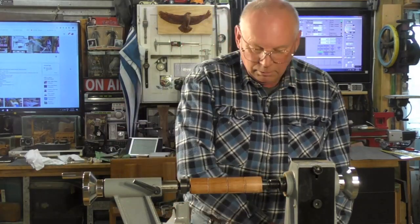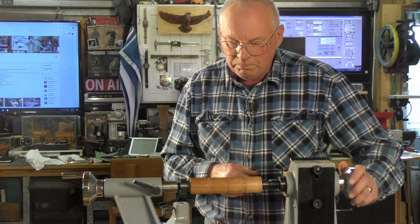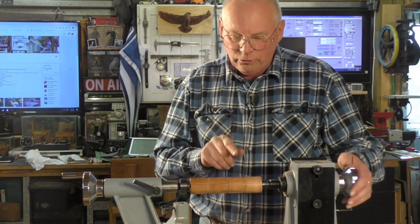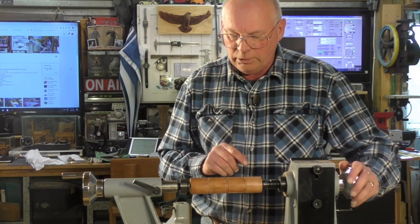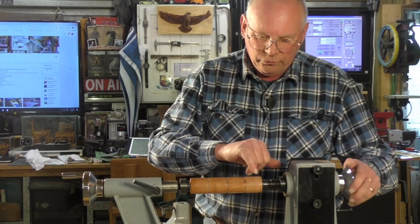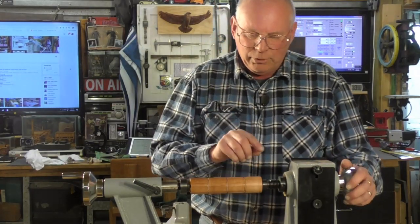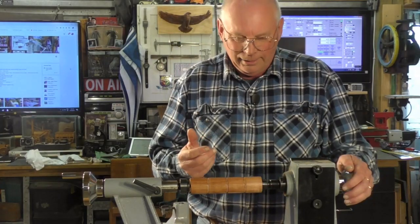I hope the cameras are picking that up, because I can actually see the difference here between them. And I know that this will dull over time. This is okay, it's an okay finish, but this is a perfect finish. I'll just turn it around so you can see. And of course, this is the control. And the lighter parts that you can see here, a bit streaky, of course, that is the dust from the 1200 grit that is sort of impregnated in. And this finish will sort of scale that out from there, I suppose.